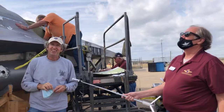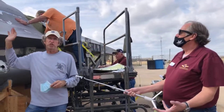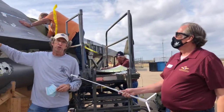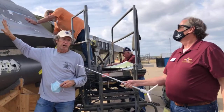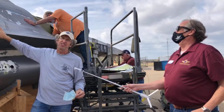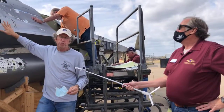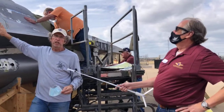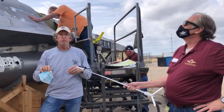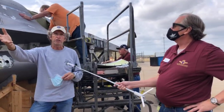This was huge — it's never been done. Getting that stretch out of there, getting rid of the bogus sheet metal work, putting it back together in a way that it's going to be solid. It's only got to hold 1G now instead of flight loads, but it's still got to support itself. We wanted to make sure we treated all the corrosion we found. There's lots of green primer on parts to keep it from corroding, since it's going to live outdoors here for a while.